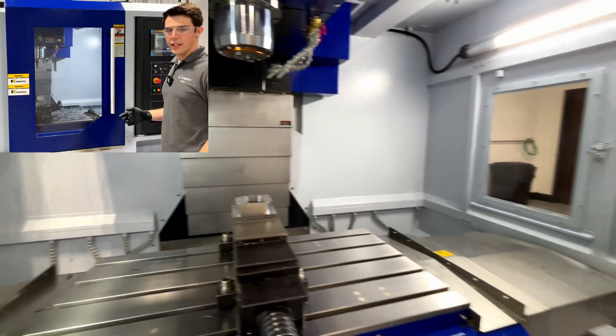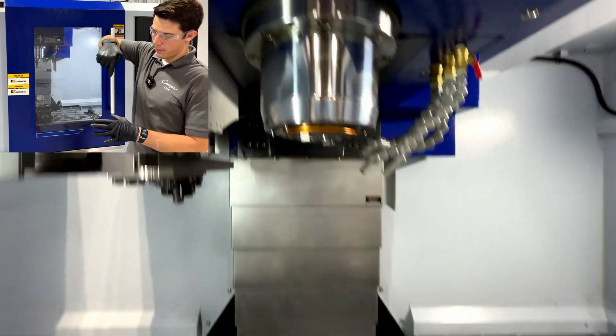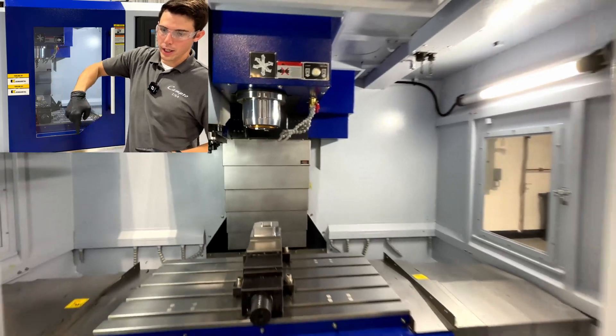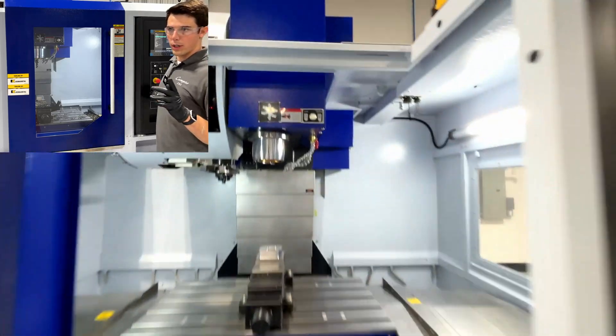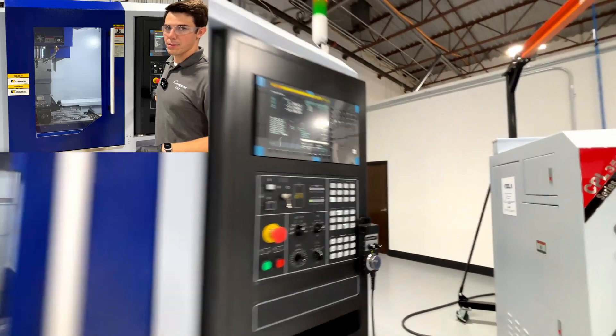This next tool is a half inch solid carbide end mill, 4 flute, and it's going to spiral in and then take a pretty good step over and open up a good pocket here. I'm going to try to keep the air blow to a minimum, but we'll make sure that pocket doesn't pack up on us.